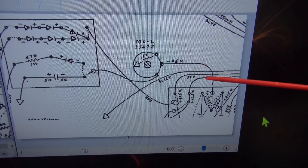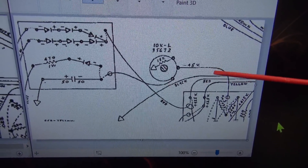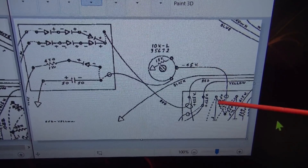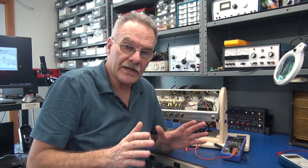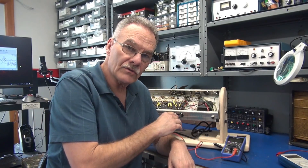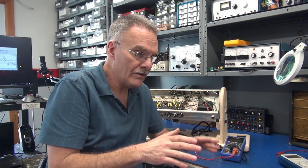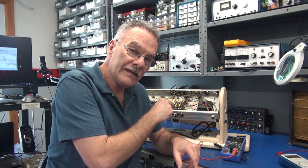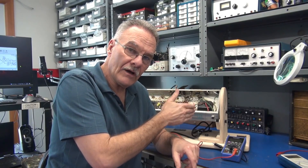This is a much better system. The only drawback is you have to have a pretty close matched pair of tubes because you're only adjusting the current at one point, which is going to both tubes. So the game plan is I'm going to reconfigure this old bias system to a variable bias system — it's a simple matter of rearranging a couple of resistors on the current pot and adding the 220K resistors that feed the output tubes.